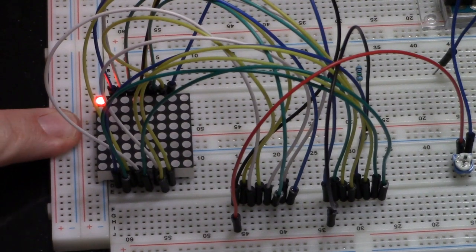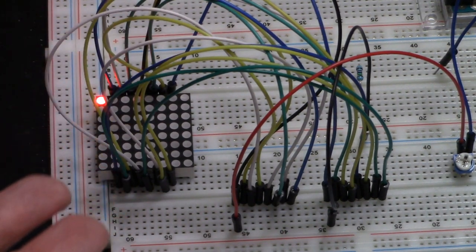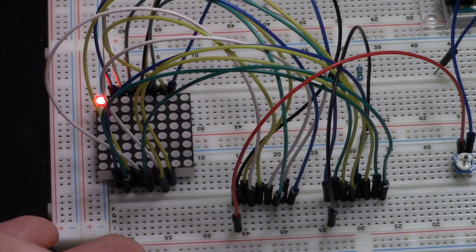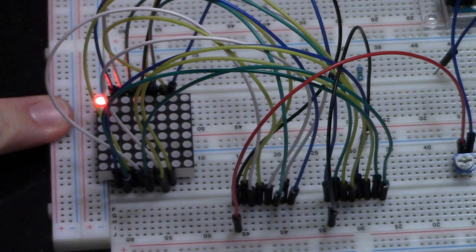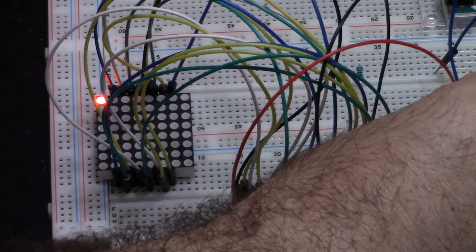Here, I can do it. So this is 1K ohms. It's bright. It's really bright. 1K ohms. It's common to see like 470 ohms for an LED resistor, but this is 1K. If I turn it down to half, which should be about 500, just look at this thing. You could see it across the doggone building. So, I mean, you can have it really bright if you want. Oh my goodness, that's bright. But you definitely do not need it that bright.